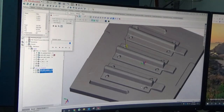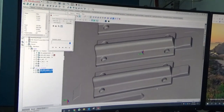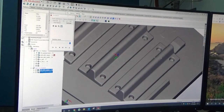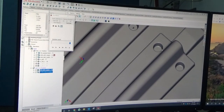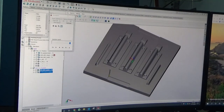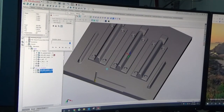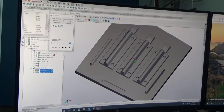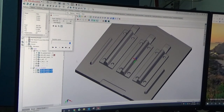Now the first pattern is completely machined - we can see the finish of that, and the second one's complete too. Everything looks pretty good. That's the finished part, what it's going to look like after we're all machined out. This is going to be made out of a three inch solid piece of wood - we machine the cope side, flip it over, mount it to a fixture, machine the drag side, and we're ready to throw on the handles and start making castings.